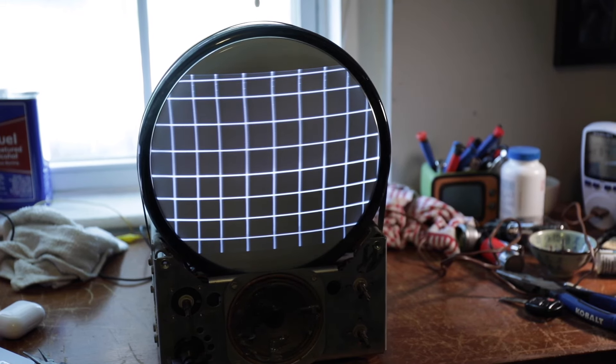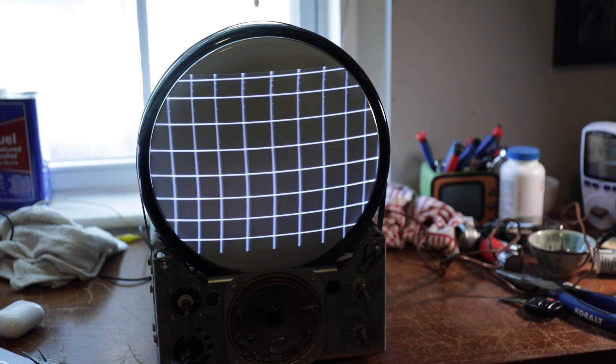I'm going to look under and test some resistor voltages. I think that's the next step — it's just not getting enough B+ I believe. Looking at the watt meter it's right at 150 watts, which is exactly what the schematic says it should be. There might be a couple resistors that are out of spec. This project is not complete yet.